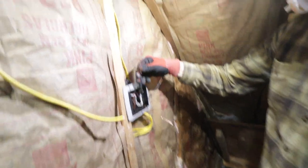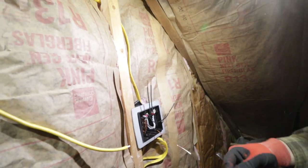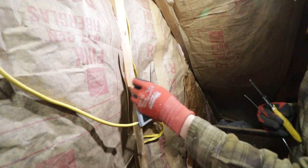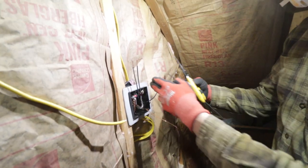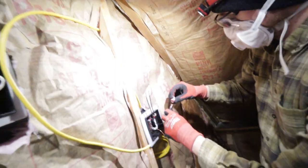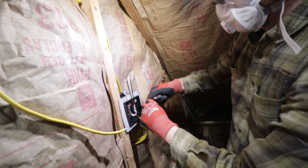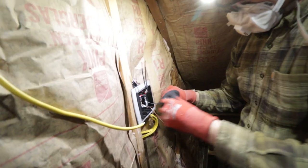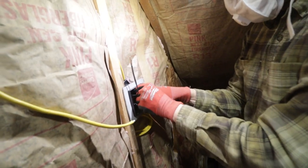These are our loads. So we're not pigtailing this, but we have to make two pigtails come out of that. So these are going to be going to the tops of our switches, and then I'm going to make pigtails come out to the bottom of our switches. And if you're from Europe looking at me like, silly American, you're right, I probably could have just used a Wago and been done with that, but...